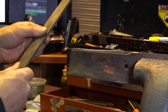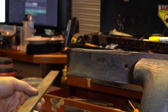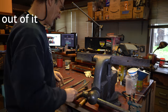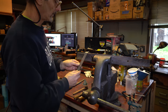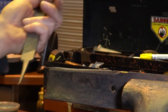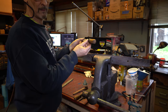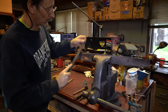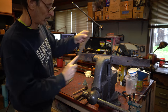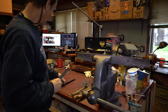Here's a newer one and this is probably worn — it's like a fine to medium — but it's doing a job; it's definitely hitting the edge. That's another nice file. This one here is pretty fine and it's got a lot of junk in it — it's just flipping over and doing nothing. This is the kind of file I'd put in a junk drawer and leave it for making stuff out of, like this one here that's already got a chisel end on it. And here's a flat smooth — these are the type of file ends I'm referring to — but it's too smooth for us.